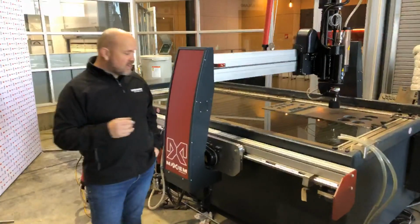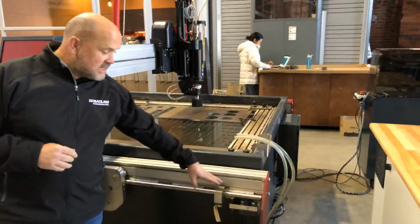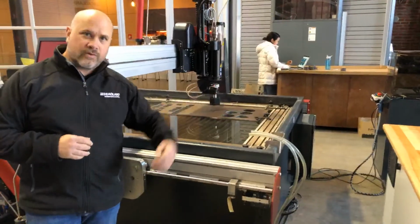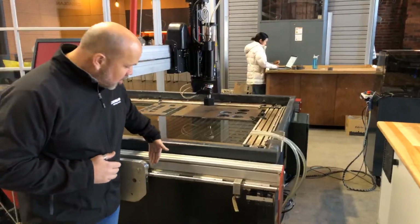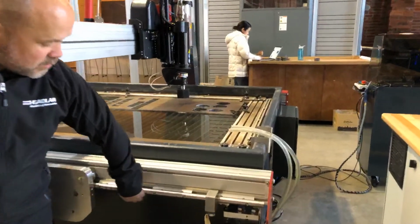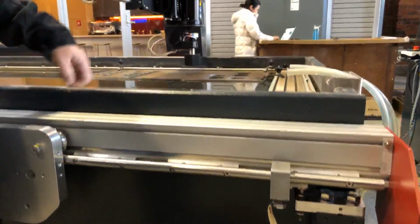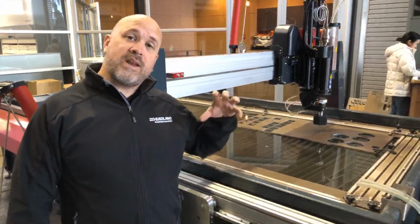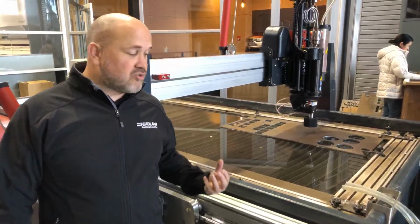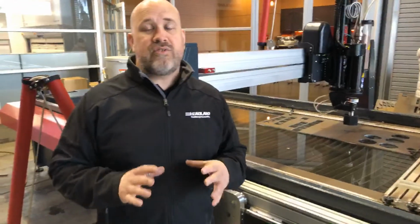Okay, so as you can see here, we have a drive rail on the x-axis. This here is a hard stop to stop the bridge from rolling off the end, obviously. We have a drive rail. On this drive rail, there is a contact wheel on the underside, which is just tucked underneath there, we can't quite see it, and there's a pinch roller on the top. What this allows the system to do is that when the drive isn't engaged, it just rolls up and down freely. It's very, very low forces, very free running, therefore it doesn't require much power to run it.